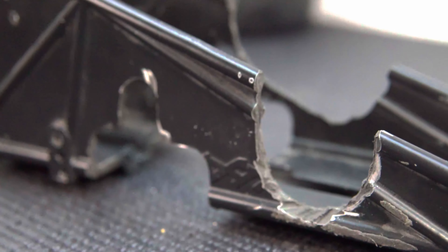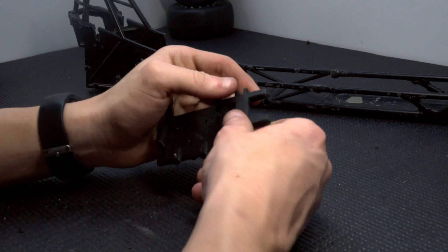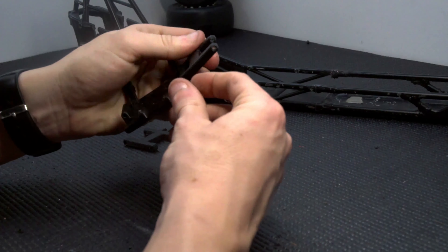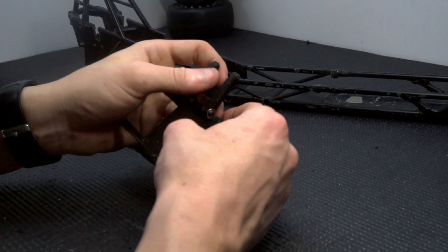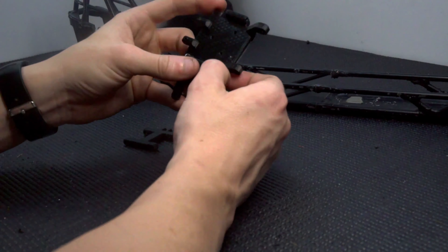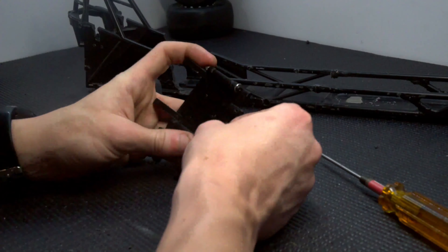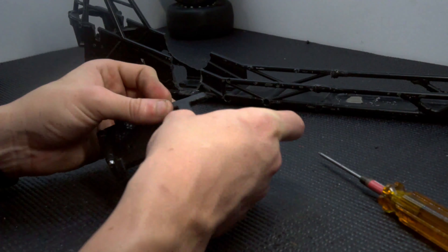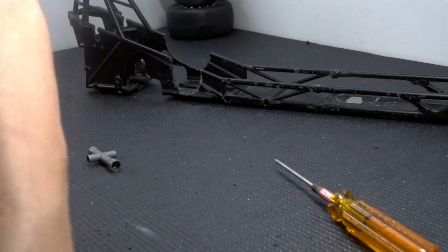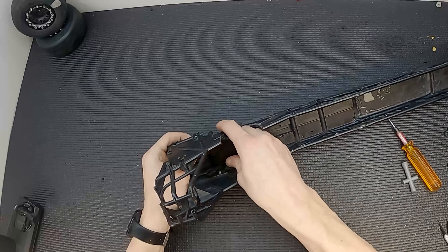You can see I have a bunch of cutouts in the chassis already. I did all of this off camera since it was a lot of trial and error to get things to fit. The rear base plate and arms are 3D printed and connected using some hinge screws I had in my randomly organized containers of hardware. The lock nuts on the opposite sides don't get tightened all the way so that the arms can swing freely. This assembly gets dropped into the chassis and then secured with 4 screws.